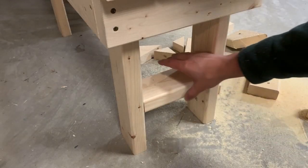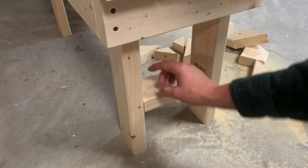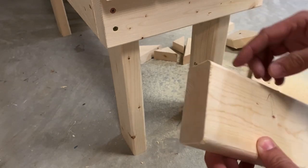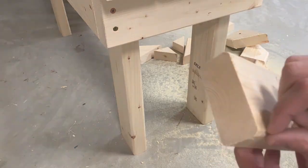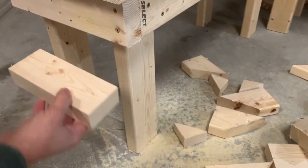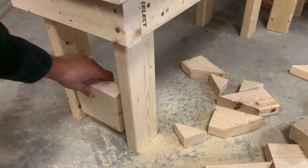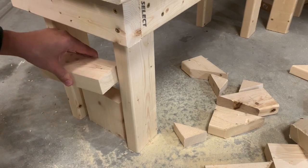One thing I noticed when I cut these seven inches — I didn't like the way that this sticks out a little bit. What I'm going to do is take this piece over to my table saw and rip off about a quarter of an inch on both sides. So I got everything cut up. What we're going to do is put this in between, and I'm going to use this block as a template on how high to set it.